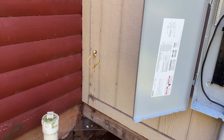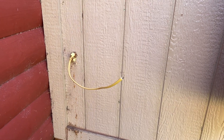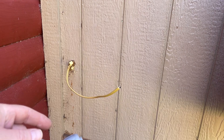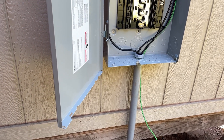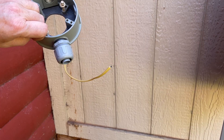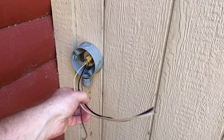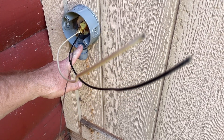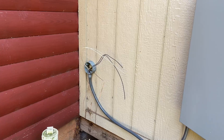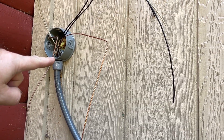We've got a slight side project. This piece of wire was existing — looks like she had another electrician run some outlets inside, and we want to make this circuit hot. So we're going to put in this box and run flexible conduit over and into the bottom of this panel, giving it its own breaker — that'll give her two or three outlets inside. Got the junction box installed, the Romex stripped, and I'm going to make my connections and run the rest of the wire down through flexible conduit. I've got the conduit secured with connections — there's a little rubber o-ring you just want to get snug so it's watertight.